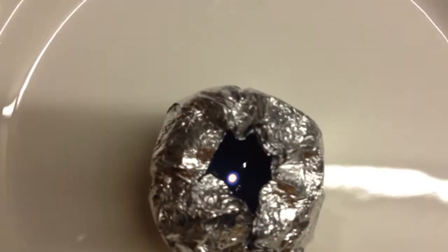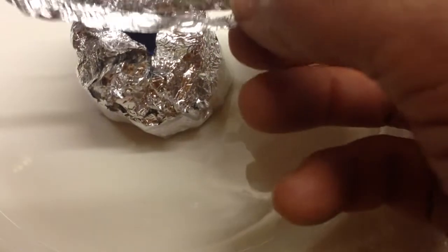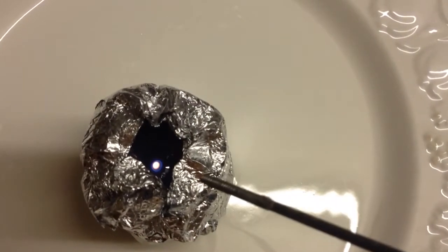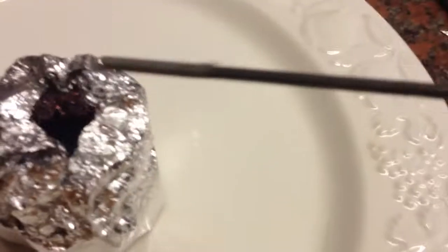If you look down there we've still got the candle going. We haven't got gasification yet. What we're after is to change the yellow light and turn that into a blue light rising about half an inch above the orifice here. I think the orifice is too big for the size of the candle and I'm not getting enough air in at the edges at the moment.